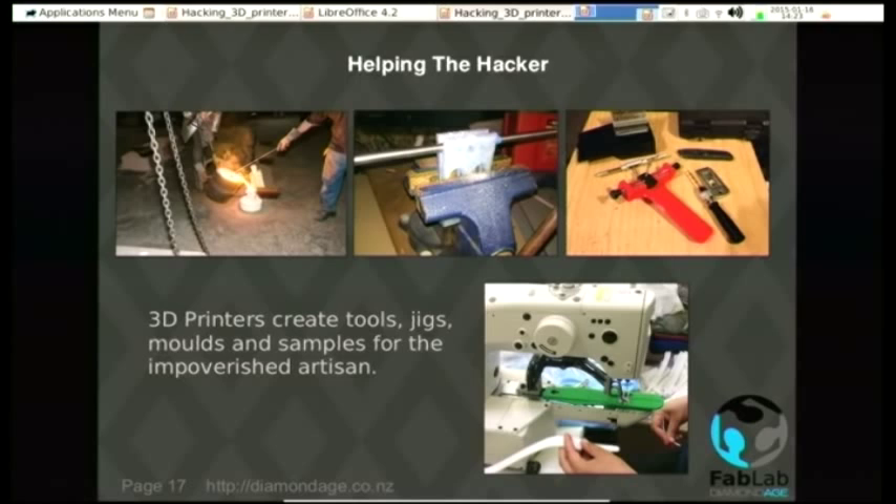While people have been using 3D printers to make parts to support their local requirements, local artisans, and hobbyists, the really hot stuff is someone using 3D printers to print the cores for a mold. The core is printed in bioplastic PLA, cased in plaster, then baked till red hot so all the plastic evaporates, then they pour metal into the resulting hole — that particular one is the Venturi jet for a jet boat. Various jigs are also being made to hold things in place, allowing people to create valuable products and compete with farming things out to China.